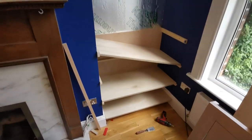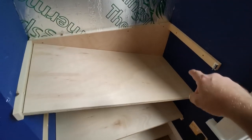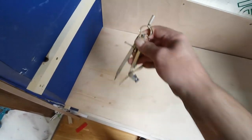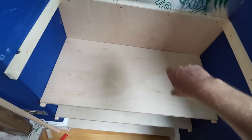With the front off I can do my normal thing — cut them slightly oversized, then scribe them. On these ones I'm keeping it hard back to the back because the front is the same distance off there. That's what I like about these scribers — I can hold that back with one hand and wind it by hand and get it right. I'm just cutting straight lines with the track saw so it's not perfect but it's pretty good. I put an X on the back right corner because you quite easily lose track of which way round it is taking them in and out.